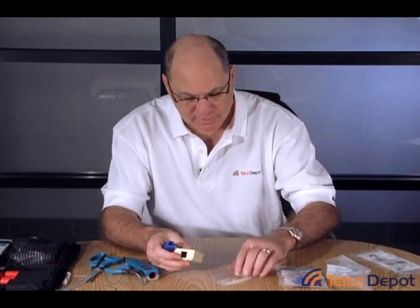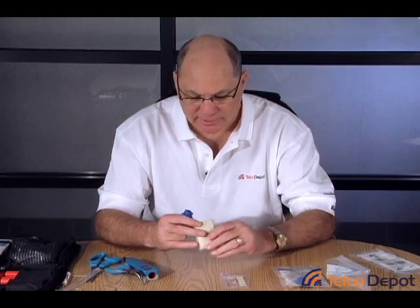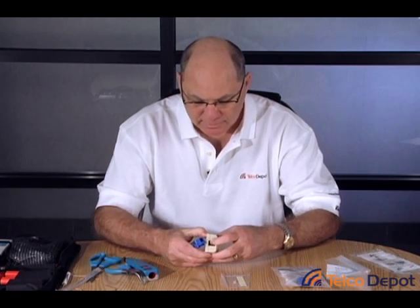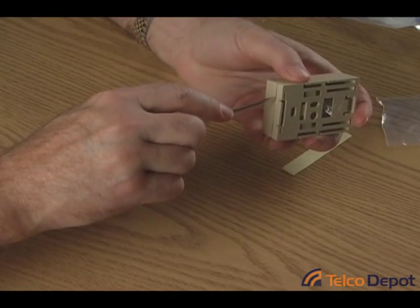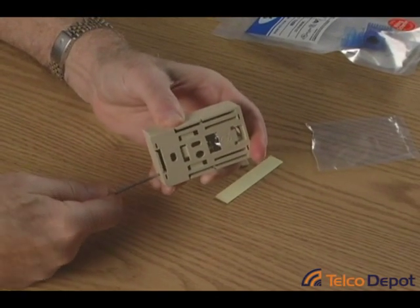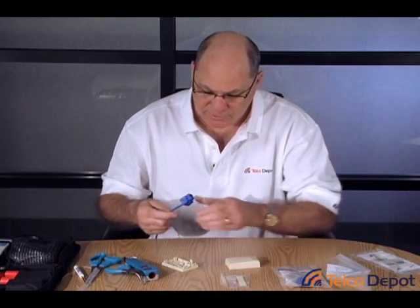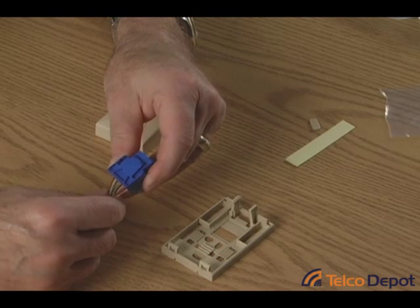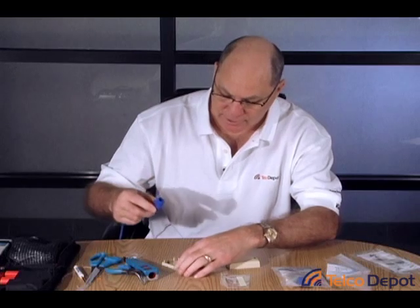When you open these boxes up, you're going to notice that it's got a double-sided sticky tape, and it's got a little insert that can fit into the top part to indicate whether this is a phone or a data jack. Pop the box apart — it's usually easiest to pry it apart with a screwdriver from the back. The way this jack goes in: on the bottom side of the jack is a little pressure release, so you want this little flex tab to be facing down in the jack.